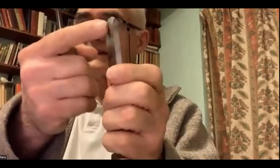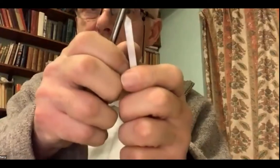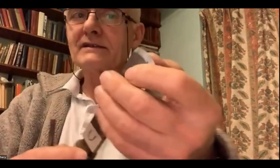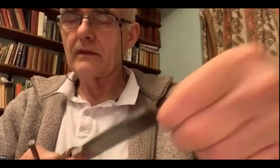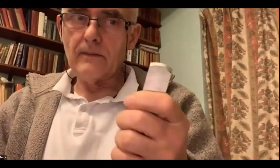Then you go to the back, and if I pretend that's the back, because you'll probably see it slightly more clearly, you put the burnisher there, lift it just a little bit off the bevel, and just go across with a little gentle pressure, not much pressure. And you will find, if you've done it right, that there will be a little hook left on the edge, which you can feel. That cuts better than the grinder burr, and it's longer lasting.